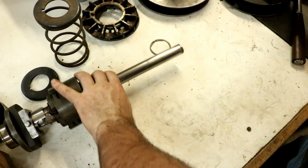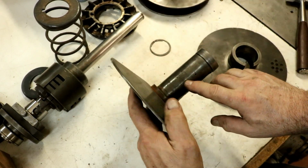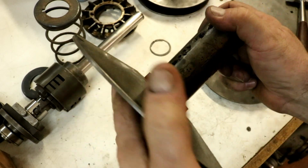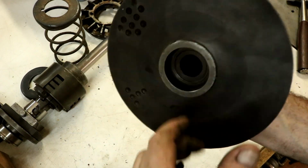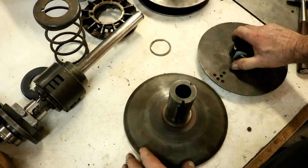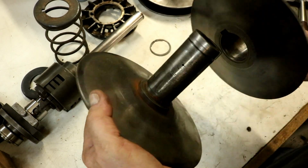So my dilemma came to the pulley that goes on here, the other Reeves side. Well, this one is completely trashed. This is the one that came off, the original. This has been welded up on the keyway, I don't know, 1, 2, 3, 4, 5, 6, 7 times, and then they put in a huge one, 1/2 inch wide. You can see all the welding that was there. There's a keyway, all welded, all the way around this thing. This is all cast iron, all one piece, and there's a bearing that goes in here. And then they chopped a big old gaping hole in it for the keyway. Right, and then there's an anti-friction sleeve that goes in here, and this usually has an anti-friction coating. So anyway, this is basically unusable unless I chop out the center and redo this whole mess.